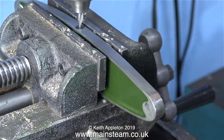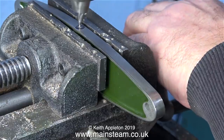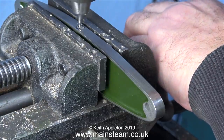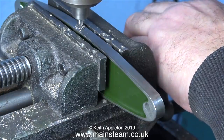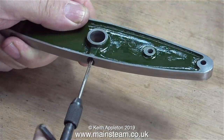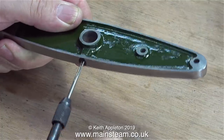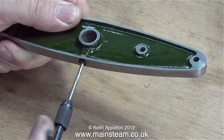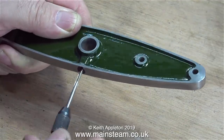This is not good engineering practice, so what I'm going to do is drill a hole in the beam. I've already shown that at one side of the beam there's a thicker part to allow this to happen. I don't have a drawing for this engine — I'm just guessing that that's what that part's for. After making a mark on the beam using a Sharpie felt tip pen, I drilled it with a center drill part way down, then all the way through using a twist drill that is tapping size for a 6BA thread.